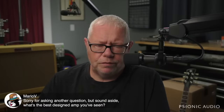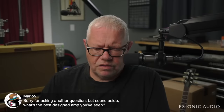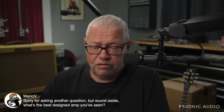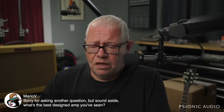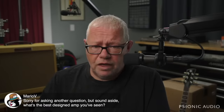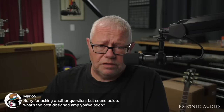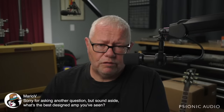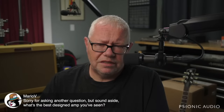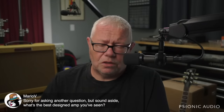If people take care of them, there's no reason. If you get one of those amps, if you're lucky enough to have, let's say, a 64, because some of them are starting in 64. If you have a 64 through 65, early 66 Fender, and you baby it, and it's always been babied, if you have what I call generational service done every 20 years, just the stuff that Leo expected to wear out, the filter caps, make sure all the tubes are good, make sure everything's clean and tight, there's no reason that they can't outlast us all.